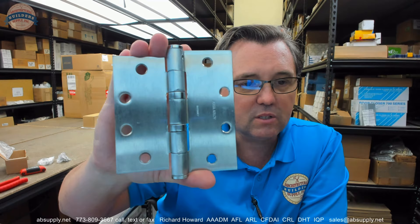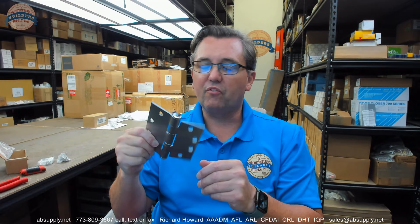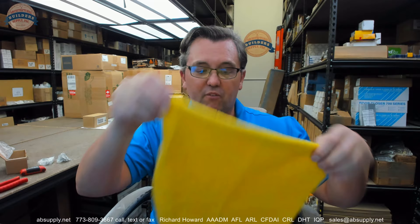I hope you don't need this hinge for the wrong reason, because it can make for an uncomfortable scenario. No one wants to order 5-inch prep on a door and frame and then have to accept 4.5-inch. A 5-inch hinge is simply far more capable of handling the load of the door — I've read a statistic that it's about 20% more capable just by going with a hinge that's a half-inch taller. In my understanding, 5-inch tall hinges would be standard practice when you get past 3 feet, especially 3'6". And for doors heavier than your typical 18-gauge, you ought to be using not only 5-inch but heavyweight as well — the 190 thousandths. This cut sheet confirmed 146 thousandths on these hinge leaves.